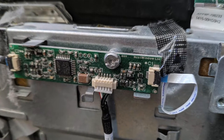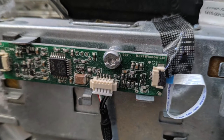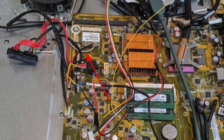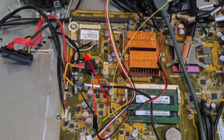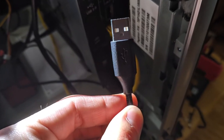The touchscreen uses a driver made by NextWindow. This driver connects the internal USB header to the motherboard, as you can see here. I chopped off the cable and soldered on a new USB port, as you can see here. I'll now show you some clips from the rest of the project.